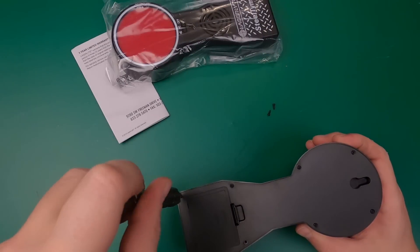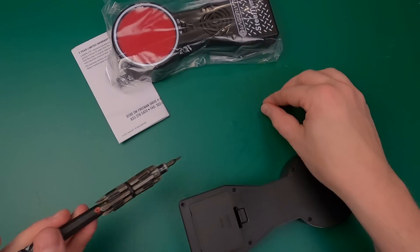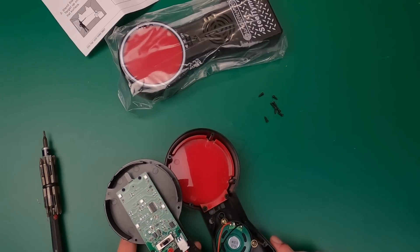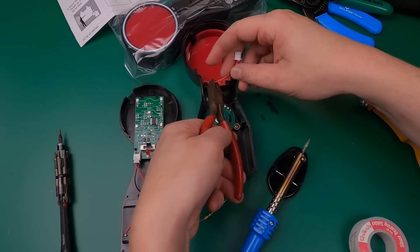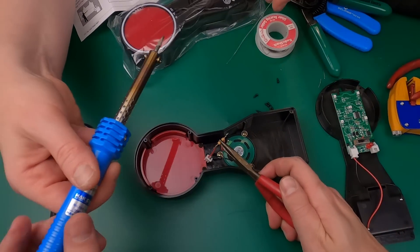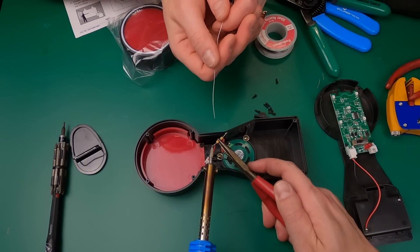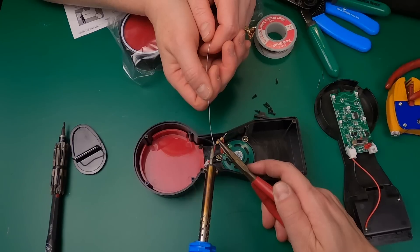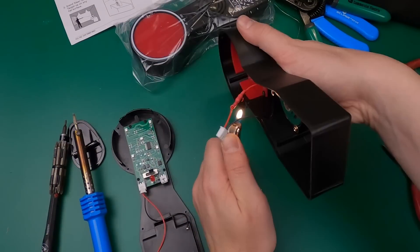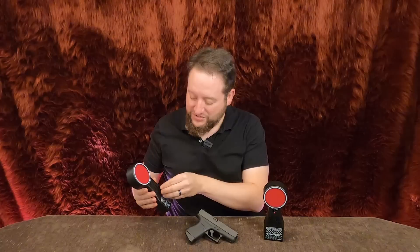The fact that it's fun is definitely encouraging me to do it more. The gong sound, while awesome, is a little loud, so I went ahead and toned that down a bit. You can do this with all kinds of toys and electronic things that have a speaker — any speaker is just taking an electronic impulse from the circuit board and playing sound. You can drop an inline resistor. I used between 100 and 200 ohms — I had a 330 ohm resistor sitting around so that's what I used. The hardest thing was just getting everything in place. Tara helped hold things steady so I could solder it on. Put a heat shrink around it so it didn't short anything out, put it back together, and now we have two little steel gong targets.